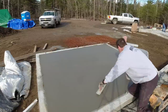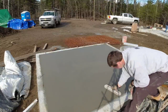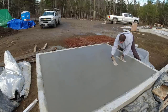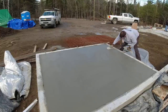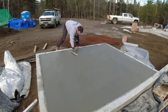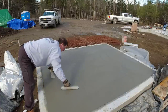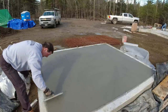And that'll be the finish surface right there — at least for the winter until springtime. They'll cover these back over with the blankets tonight to keep them protected. That way the concrete doesn't freeze — if you just leave them exposed and temperatures get below freezing, there's a really good chance that top eighth inch of concrete will freeze. Eventually that frozen top eighth inch will start peeling off and popping and just make a mess. You've got to figure out a way to keep it from freezing, and usually those blankets work pretty good. Well, that's it guys — thanks for watching, we'll see you on the next one.